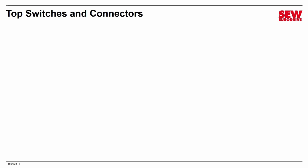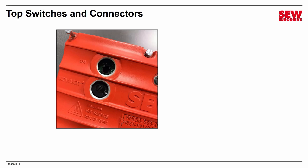If you look at the top of the control head, there are two connections underneath plugs that you have to remove — and remember, if IP rating is important, be sure to torque those correctly when finished. On the bottom is the F1 dial. This is a potentiometer you can rotate with your fingernail or a screwdriver. It goes from 0 through 10 and turns smoothly, so you can set it between numbers. In binary control mode it establishes one of the two speed set points. In RS-485 mode it sets the maximum speed.